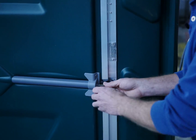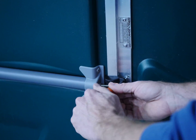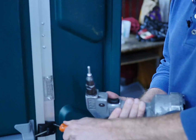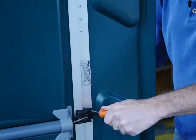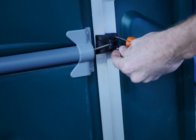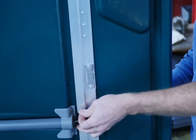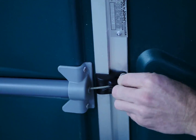I've got an awl — you can use anything small and sharp to help guide it into the hole. I'm going to pull that into position. Then using a rivet gun with a PC-000109 rivet, I'm going to insert this from the outside into the bottom hole. Take my backup washer. And using another 109 rivet, lift back up. Complete installation.